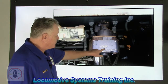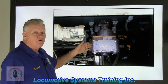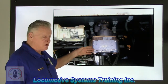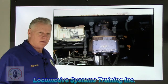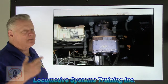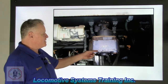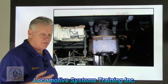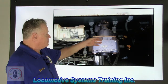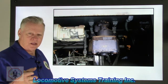Now you can't read it there, but I can barely make it out. That means 45 pounds in, 45 times 1.6. So you have two diaphragms. You have a 100% diaphragm, so 45 times 100% is 45. Let me get that straight. 60% of 45 pounds would be 27. You take 45 and 27, add them together, the output of this guy would be 72 pounds. Remember what I told you before from the last couple of classes?